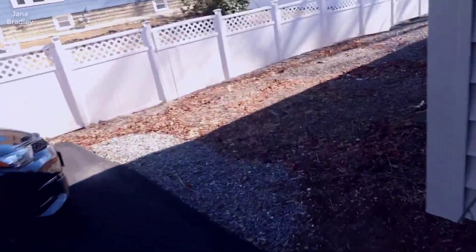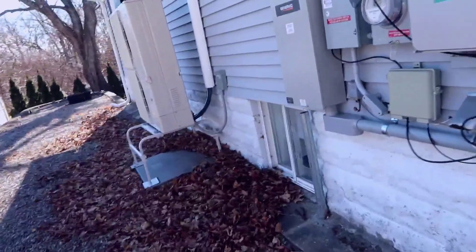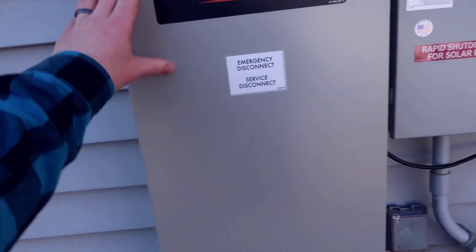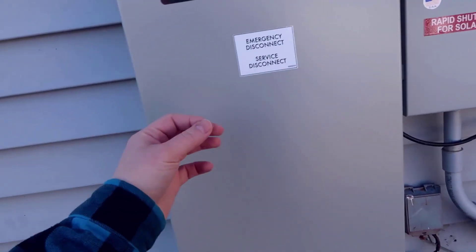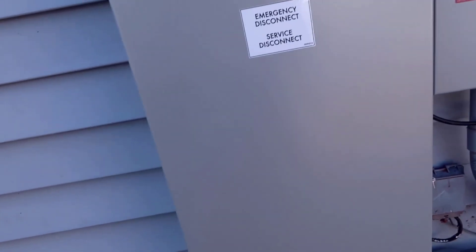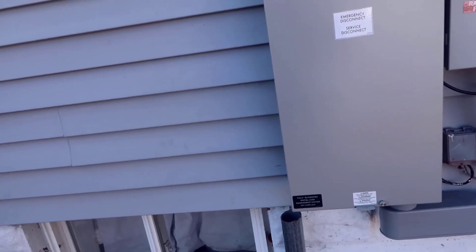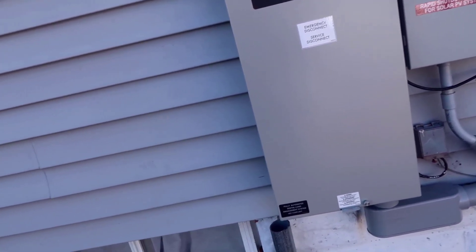Our main breaker is in the basement corner of the house, so I hired an electrician and had them install an automatic transfer switch. I wanted to future-proof so if we upgrade to a standby generator later we can do that. This switch has a small pencil-style switch you can insert to act as a manual transfer switch — flip it down, it shuts off all power from the grid, and now I can connect the generator to that 50-amp connection and run the entire house.